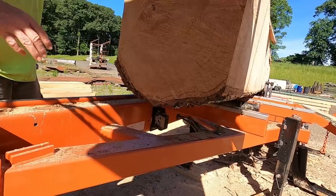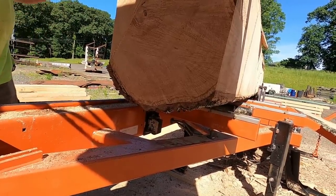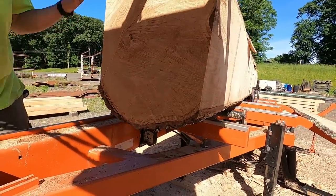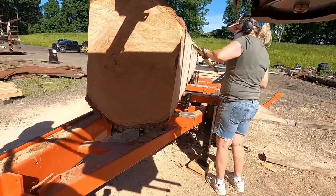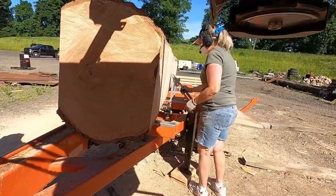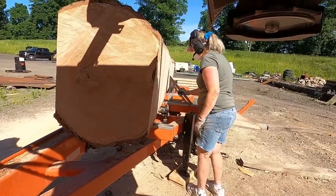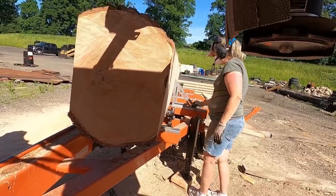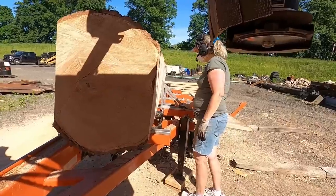So that means our pith is leveled in this direction now. So we're going to go ahead and get it squared up, because you want a beam to be nice and square, right? Okay, you've seen us do this in previous videos. What Deb is doing is she's setting the square down on the mill rails, on the mill bed, and up against the log, and she'll tell me which way I've got to move it to get it square. So the bottom towards you.